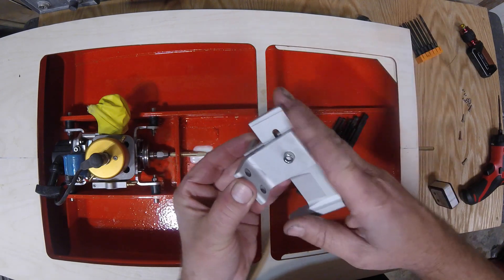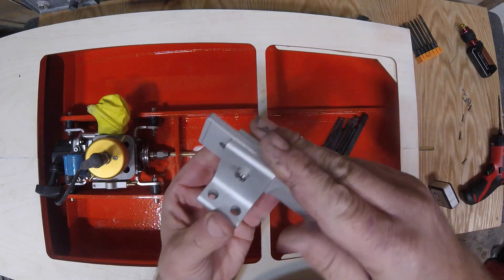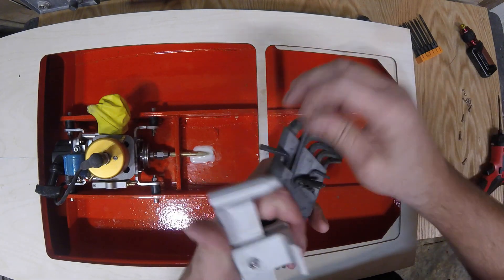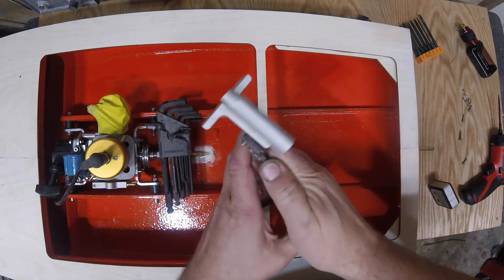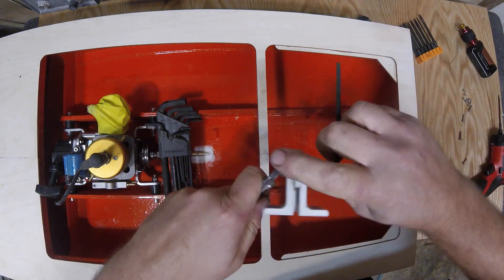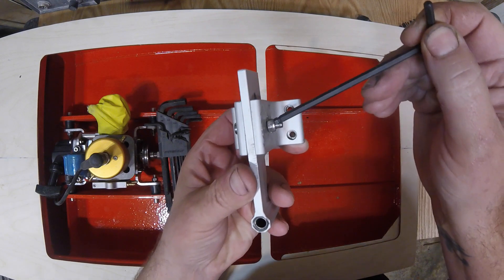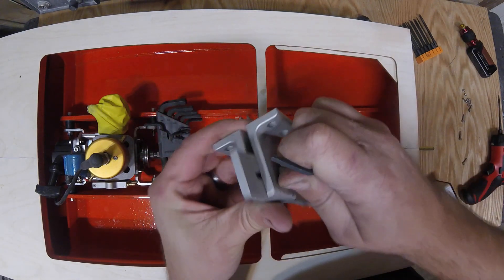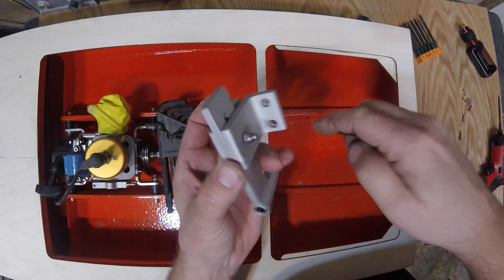It is aluminum, very well made. It's a strut — you've got a brass bushing in here. So this is what I call a double lock system. You have a lock nut with the neoprene in the middle, and this side of the bracket is threaded. When I'm down at the water tuning, I don't necessarily tighten the nut first — I'll tighten just the bolt. Then after I find my sweet spot, I tighten the bolt and the nut to really lock it in place.